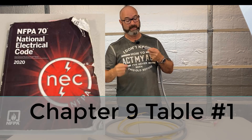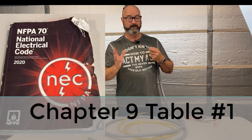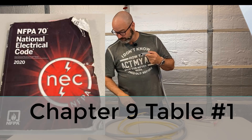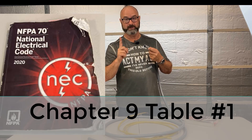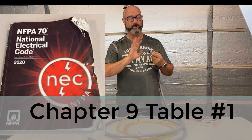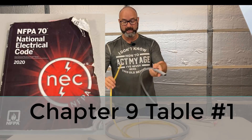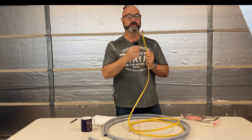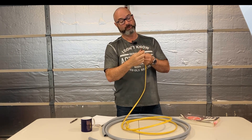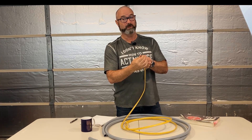If you're going to do it, let's at least know what we're doing. We used to always say basically if it fits it goes — old guys will remember this: if it fits it ships. Not really code compliant, but it does work. In Chapter 9, Table 1, it says for a single conductor it's not supposed to fill up more than 53%. A multi-cable conductor like Romex is sheathed — it's not individual — so it has to be considered one conductor. Whatever this cross section is for the whole cable is how the code wants you to approach that.